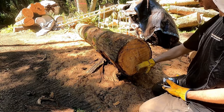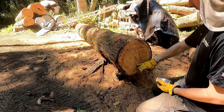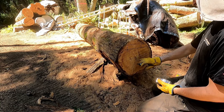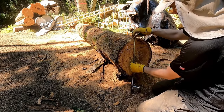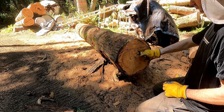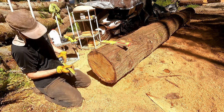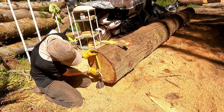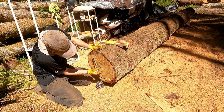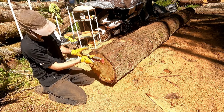Now I want to know where the center of the useful part of this log is vertically. I'm going to use the ring center — just take a look at the log. Sometimes this is way off to one side, but this one's pretty concentric, so it looks good. I need to know the distance between my first cut and the center of the log. I'm four and three-eighths up here, so four and three-eighths is the magic number. Now that we know that, we go to the other end. This is the big end of the log and the grain is a little more eccentric. The edge of useful wood is about eight and an eighth. I'll use the center of the grain as my starting point and go up four and three-eighths from there — that's the height of the first cut on this side.